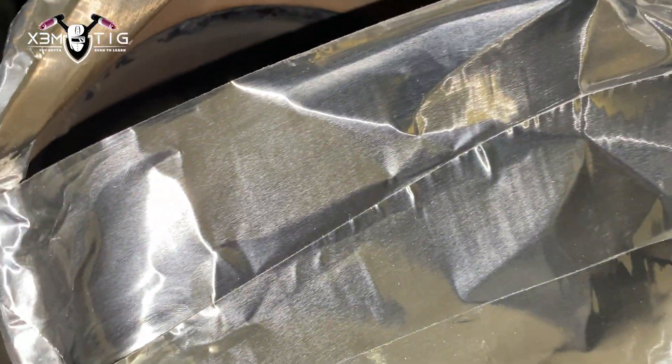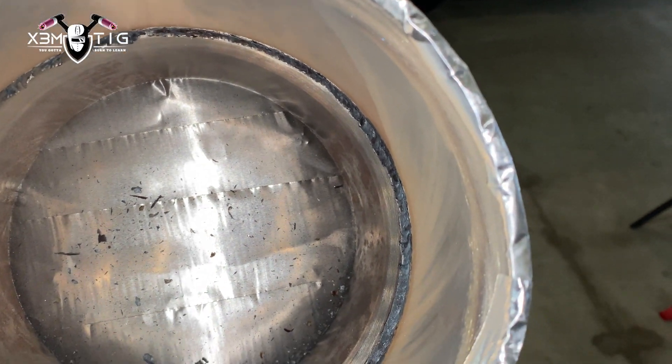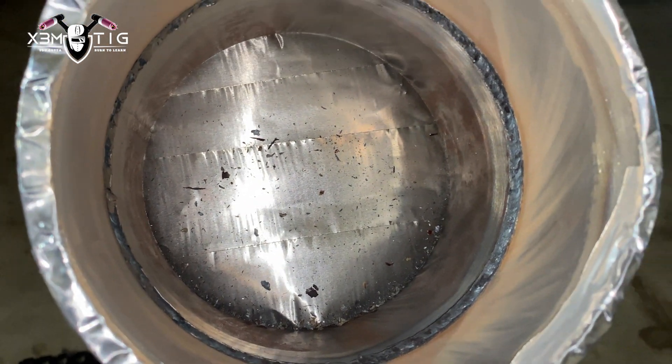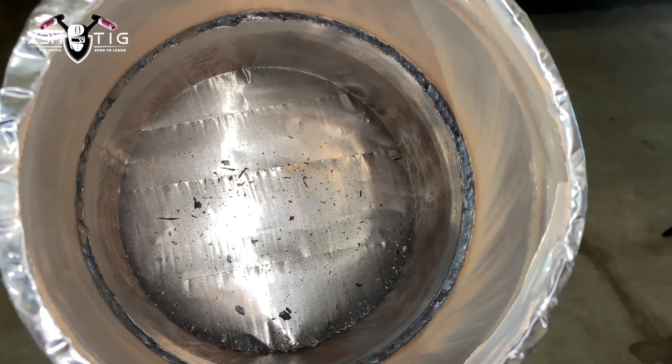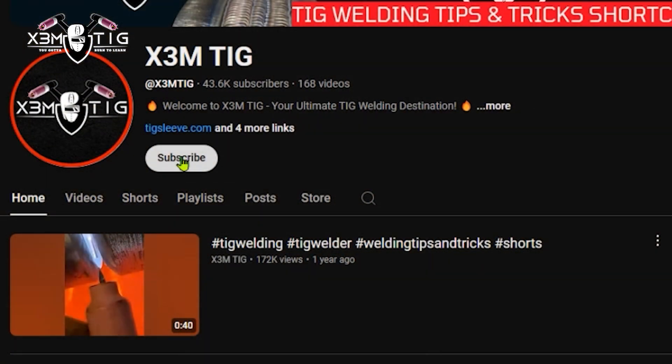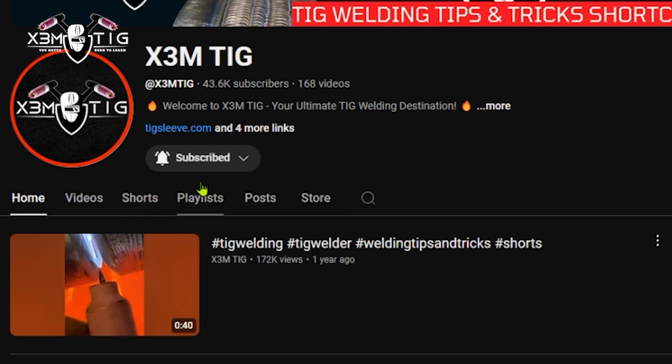Always keep in mind the proper steps prior to welding: inspect all your gear, make sure your torch is good with no leaks, and everything should be fine. Now let's open it up and check the root inside after the hot pass. That's it — looks nice, pretty much almost perfect, a nice beautiful ring all the way around. That's how it should look — it'll pass any x-ray or bend test. If you liked this video, make sure to subscribe and click the bell icon for all notifications. It's free and helps the channel a lot — thanks and see you in the next one.